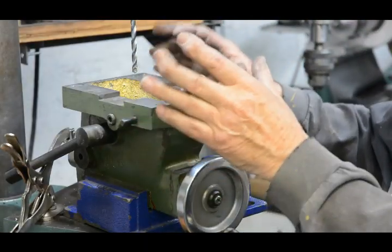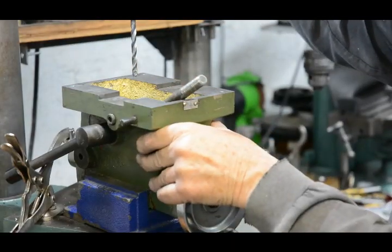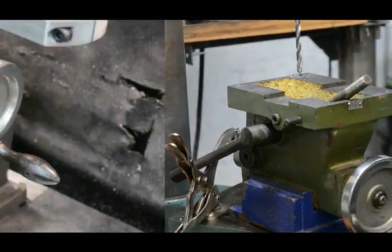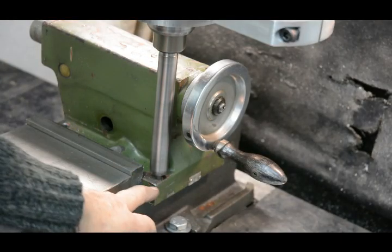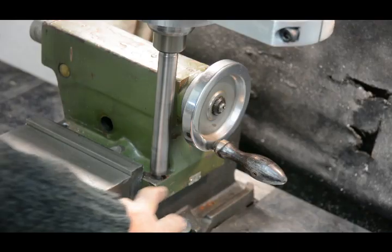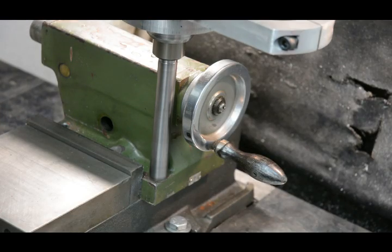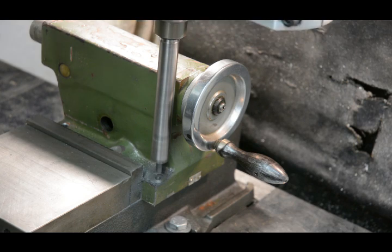The top part is now back in the drill to have these holes taken out to their final size. The tailstock is now set up in the milling vise with a spot facing tool in the mill — basically just to give a flat surface for the heads of the bolts to sit on and be able to move backwards and forwards when adjusting. That looks pretty good.